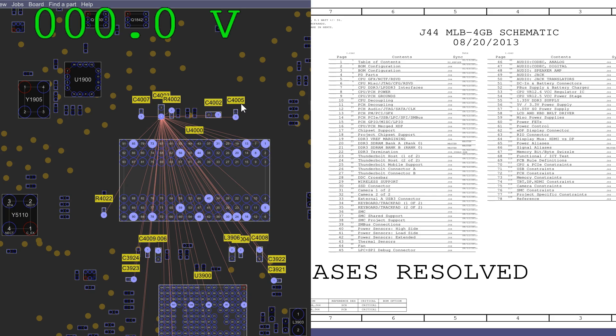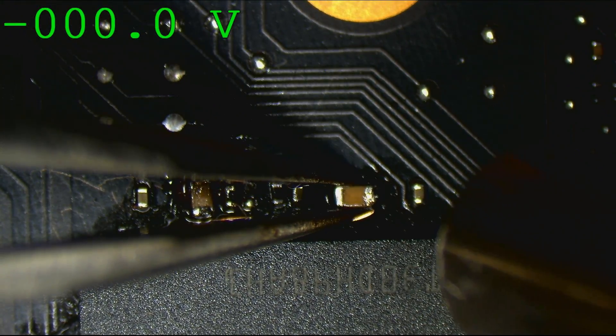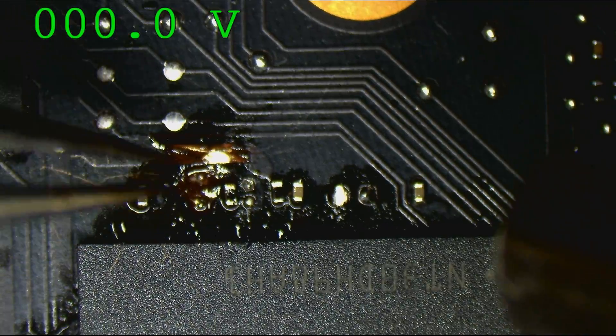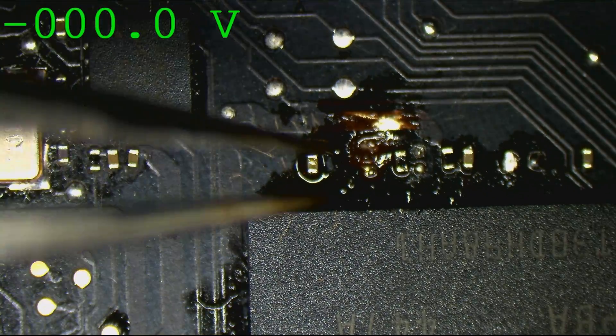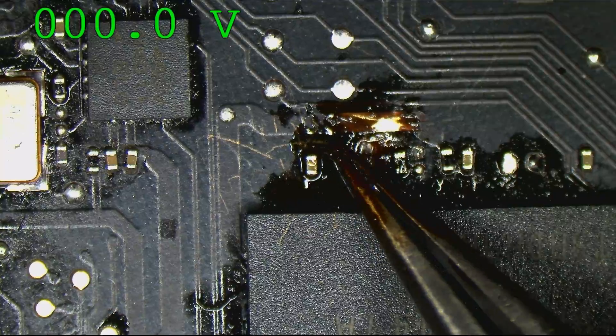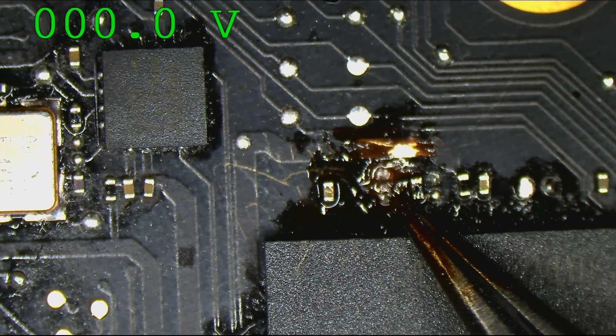This is for a camera — I don't care about a camera, this thing doesn't turn on. I kind of want to see what's going on under that. I may actually remove this chip — I believe this is a 512MB buffer chip for memory. Keep in mind, if there's a hole in this section of the board, this tells me damage occurred here and that this board was likely cleaned before it got to me. The thing right next to it is a clock chip that creates a 32kHz clock to talk to the CPU and PCH. The CPU and PCH is what creates PMSleepS4L, which is missing. So let's see if we can replace this clock chip with one that works, because it does indeed happen to be messed up.